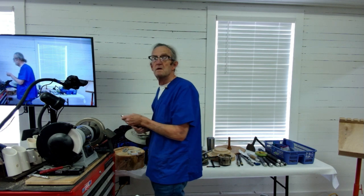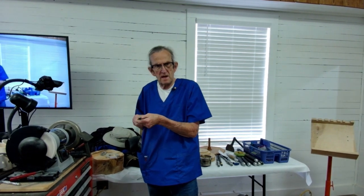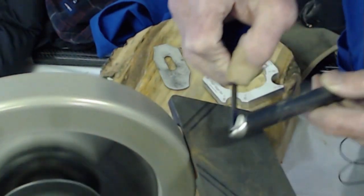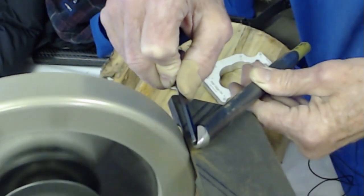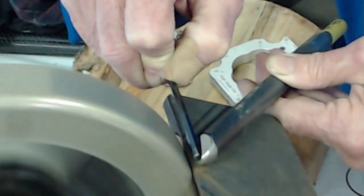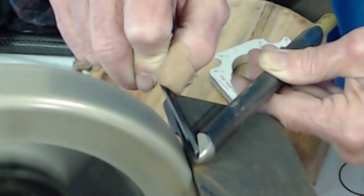Trey: This might be a dumb question. Whenever you're doing the wings, or 40 degrees on the wing, how do you orient the gouge? How much is the gouge straight up, or how far? I rotate it over, and that's not a dumb question. I rotate it so the flute of it is horizontal. The flute is horizontal? Okay. See where this part is horizontal right here, that I'm holding against it. Not like this, not like that, but that's horizontal is where I'm cutting at. And that's the angle that I'm cutting on. I'm on 40 degrees here, and that flute is flat there.